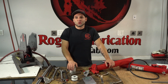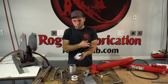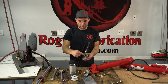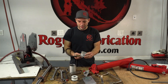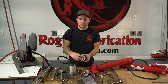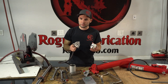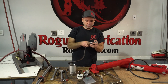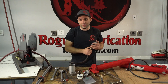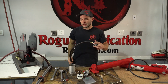My last bit of advice covers two more gotchas on these hydraulic cylinders. The first is how far you thread the air fitting into the cap of the air pump. If you put this banjo fitting too far into the cap, it will stick through the threads far enough to interfere with the piston's movement — it'll actually stop the piston from coming all the way up. If it can't come all the way up, it will only cycle one time and stop forever. The remedy is simple: take it out, put more tape on the threads, and don't thread it in as far. The threads will not protrude into the piston area and it will operate as intended.